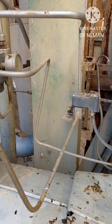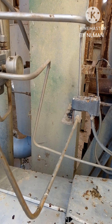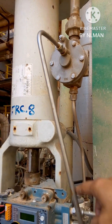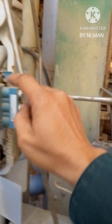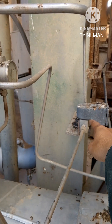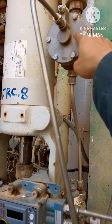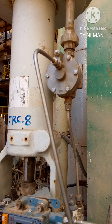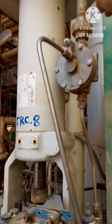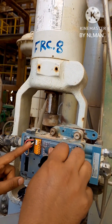This here is the solenoid. The solenoid serves as a shutdown signal — any time there is a plant trip it will cut the signal. This is the output of the positioner going to the solenoid, then going to the booster relay.